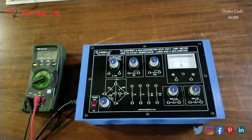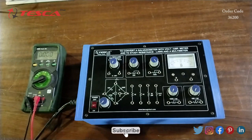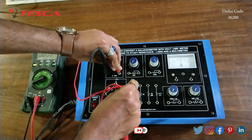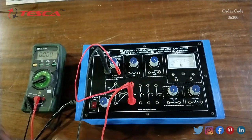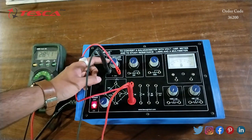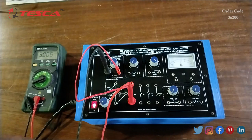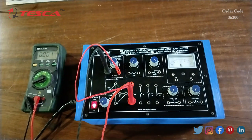For current measurement, we shift the multimeter to milliampere. We connect the negative to the DC power supply and connect a resistance as the load so that we can measure the current, then connect the positive to the other end of the resistance. We switch on the kit and give some supply. Here you can see that when we give some voltage at the DC supply, we are getting 2.9 milliampere current. That is how we can measure the DC current across a 1k ohm resistance.